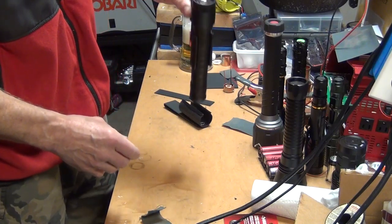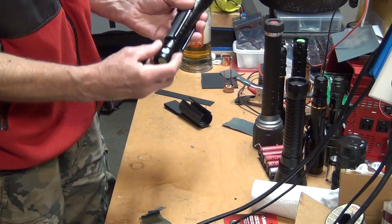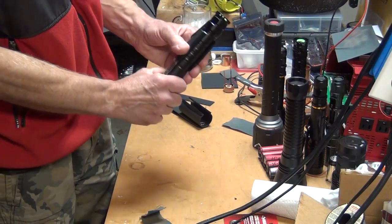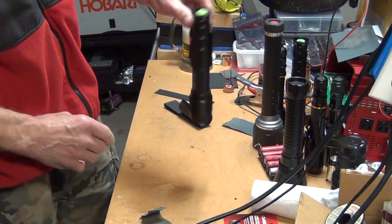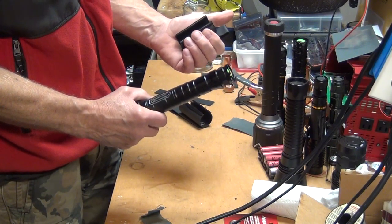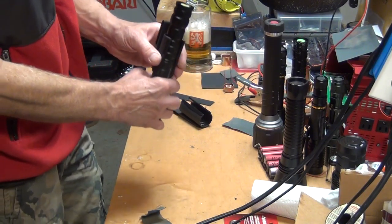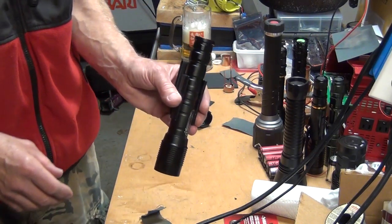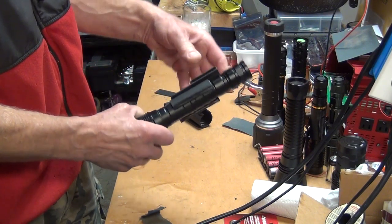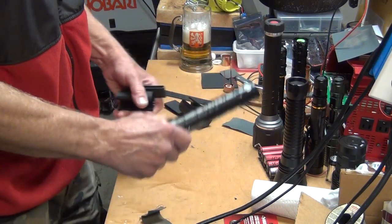You can hear how it clips in nicely — it's not coming out. It might slide down but it will stop on the head, or this part is a little bit wider so if you carry it like this it will get stuck right here — it's not sliding anymore and it's not coming out either. So it's a nice tight fit. The kydex is 0.060, which is about one millimeter, and the clip is also one millimeter kydex.